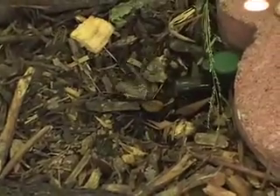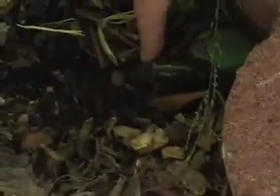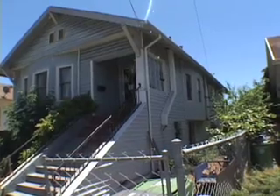It takes very minimal maintenance — just right now was my maintenance: I just scraped away the wood chips that had built up around the emitter. You can see it's open — there's no drip irrigation, it's a half inch full opening. The materials are really easy to work with; none of this is glued. The great thing about this one inch HDPE polyethylene tubing is it's really easy to work with — you can just cut it with a little saw and push things together. Inside the house you do need to glue and make sure there's no leaking, but outside if your gray water system has a drip, you brought it out here to water anyway so it doesn't matter.